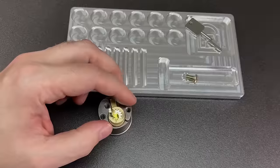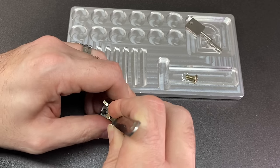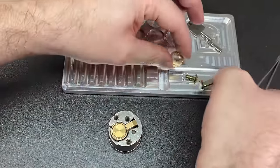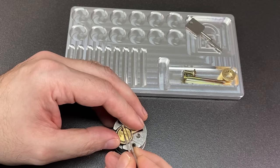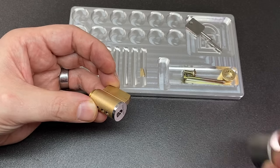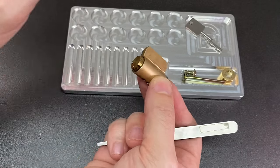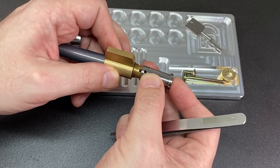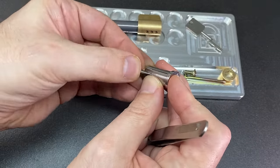First thing I'm doing is taking the tail piece off - I'll depress this little pin and then unscrew the knurled tail piece and remove it from the back of the lock. Take that bit off, take this bit which interrupts the door latch off. Then we take this whole cylinder out, move the lock body away, and tip out the little spring which goes on with the locking pin. Then I need a follower, and that just goes in.